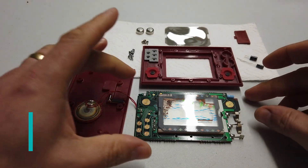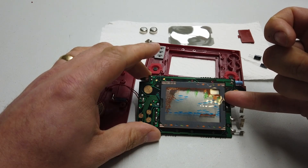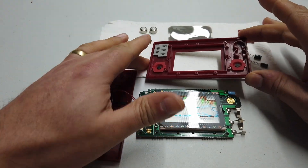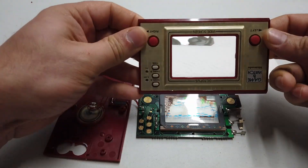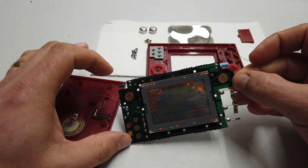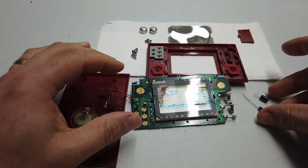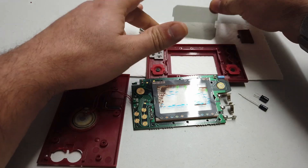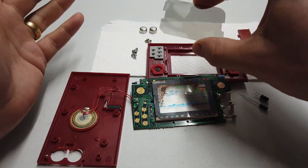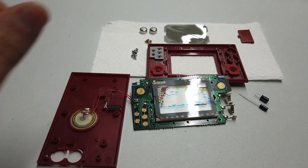I've started work on Octopus. Just noticed that the little silver reflective screen was poking out. This one is in much much better condition — it's clean, just needs a little bit of a wipe over. I'm going to go ahead and replace those capacitors — this little tantalum bead and this little electrolytic. I've cleaned up the screen very carefully, holding it by its edges. There's just a very tiny mark around the outside but nothing significant.